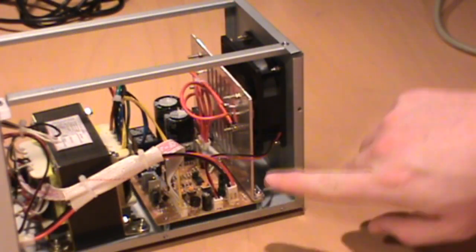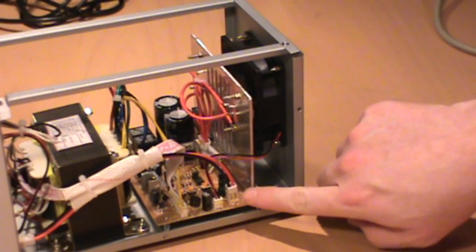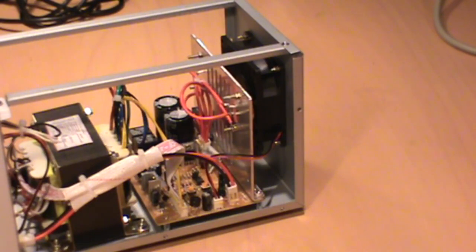Found directly in the back, right above the location previously identified, is a standard PC-based 80mm case fan. This particular unit does not appear to have a high quality fan, hence the amount of noise that's being generated. I think while I'm already in the case, I'll go ahead and swap that out for a much higher quality standard PC-based 12-volt fan.